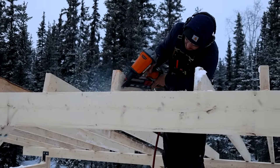And then a pretty common piece of lumber is a 2x6, 16 feet long. For our rafters, we used 23 of those. Is that including the front? I can't even remember. The front is 2x4s, so that's just the back rafters. Yeah, 2x6x16. Those are $18 a piece at the Home Depot. And then the big beam across the front, just the center one. This is the most comparable one I could find. It's a glue lam beam, so it's a laminated wood beam.